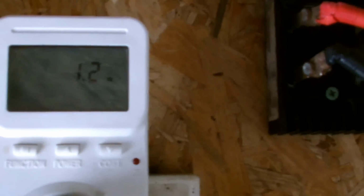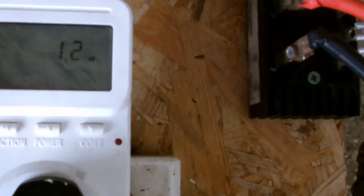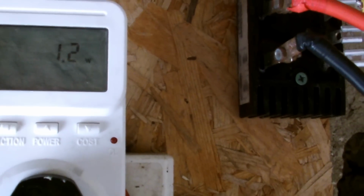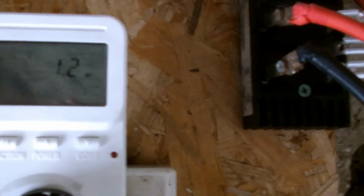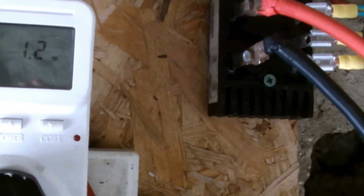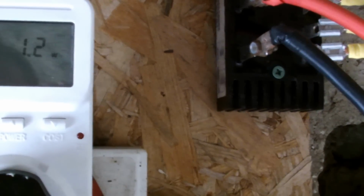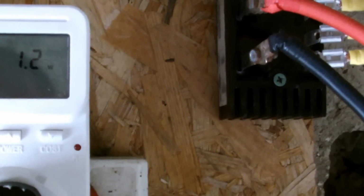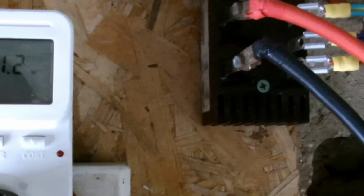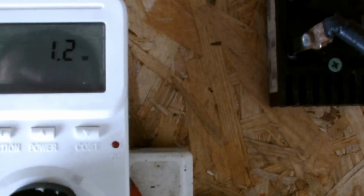It's just this wind turbine job. I don't want to spend a lot of money on another wind turbine and find I'm just not getting the watts. On a day like today, where we're averaging maybe 10, 15 mile an hour winds, I want to be seeing 100 watts, 150 watts at that sort of level, and peaking at maybe 200 or 300 watts. Would that be unreasonable for a 500 watt turbine? I don't know. That's what I'm asking.